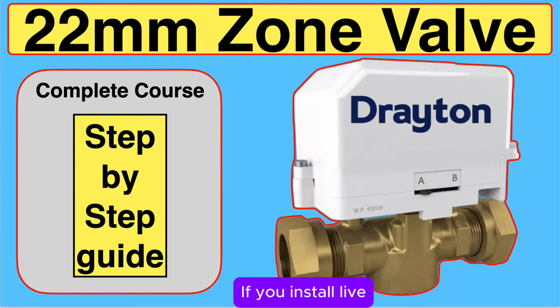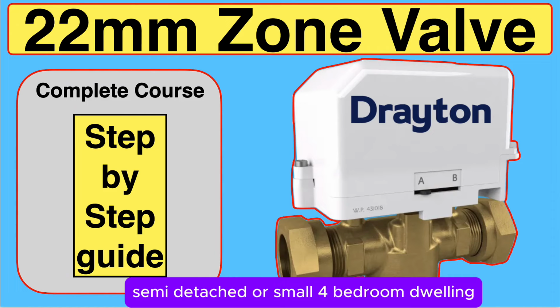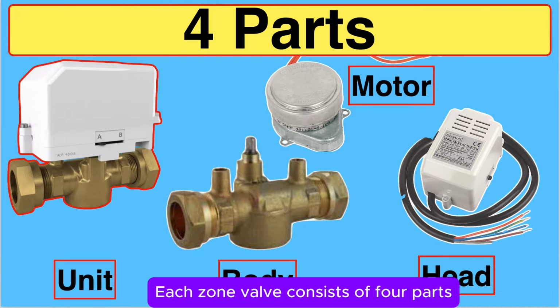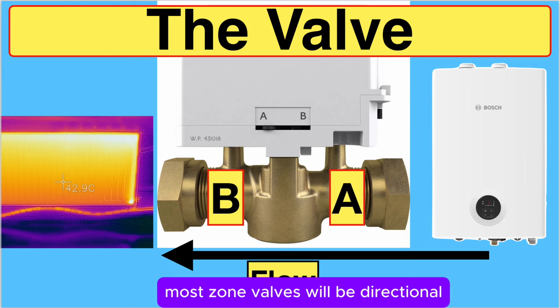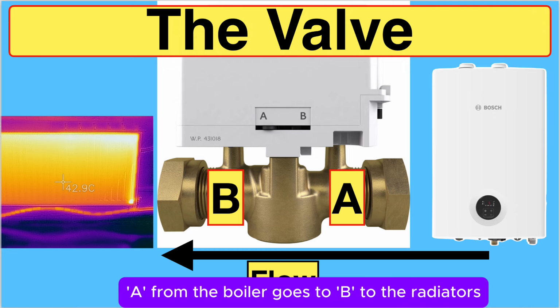If you install, live or specify heating systems into a 3-bedroom, semi-detached or a small 4-bedroom dwelling, maybe on 3 floors, this video is for you. Each zone valve consists of 4 parts: the unit complete, body, motor and the head. Most zone valves will be directional, so have a look at the arrow on the body.